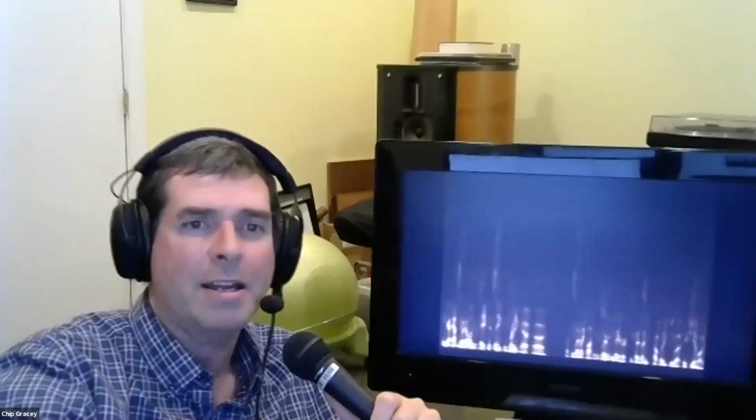Somebody asked, what is the minimum sampling window possible given the butterfly approach and, say, a 240 megahertz base clock speed for this FFT? Okay, it sounds like you're wondering what the performance of the FFT is. Ask again if I didn't get it right, but if you're asking how long it takes, this is running at 250 megahertz because I'm outputting to HDMI. So it's taking just a hair over 3 milliseconds to do a 1024 point transform. That's about 10,000 instructions, and 3 milliseconds at 250 megahertz is 750,000 clocks, divided by 10K is about 75 clocks per operation. And that could actually be improved.